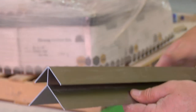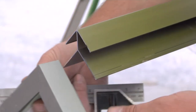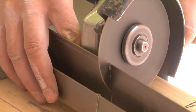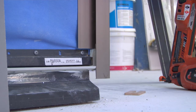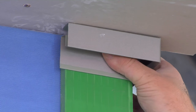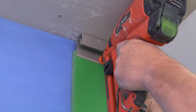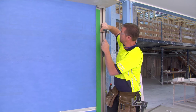The aluminium corner option is the most straightforward to install. When cutting to length, remember to deduct the height measurement of the eaves trim. Cut and notch out for fitting over the starter strip. To maintain the 15mm cavity, first tack green spacers on each side of the corner stud. Allow a small amount of breathing room at the top. Fix the eave corner piece, then, ensuring the corner trim is level, nail it through the spacer to your frame.